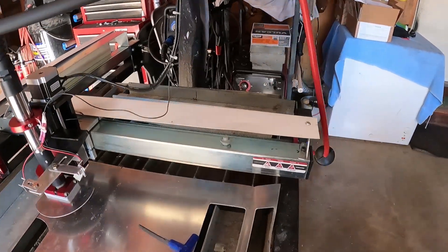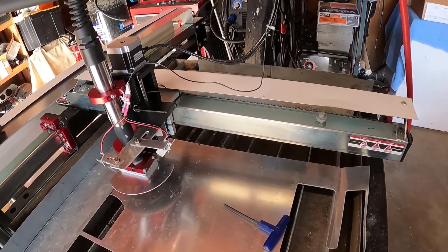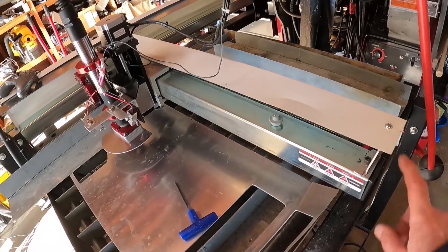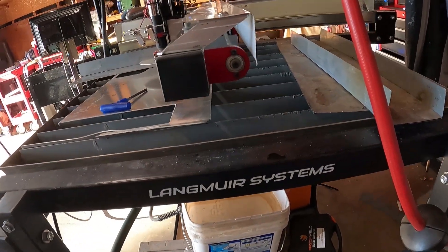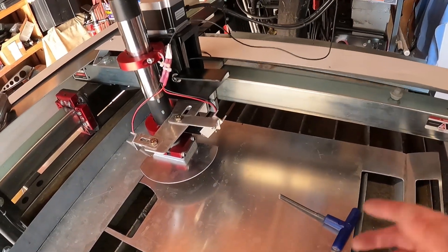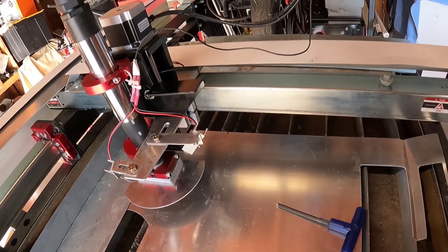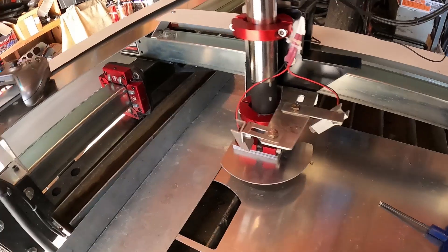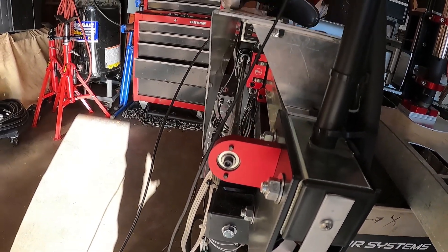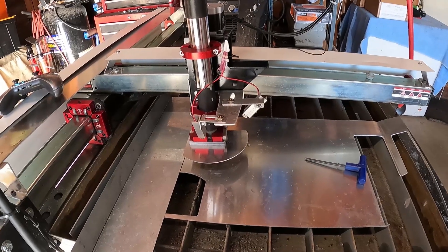The last thing I'd like to cover is the lead screws — the X and Y main lead screws. The accuracy of our machines is dependent on how clean and precise these lead screws are. I've designed a set of dust covers for them. Here's one for the X-axis — you can see how it mounts and basically covers the lead screws. Water comes down and splashes over, and it does a pretty good job protecting them. We have the same thing for the Y-axis — you can see the lead screw there and how the dust cover basically covers it. Thanks for watching, catch you on the next video.